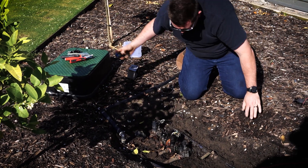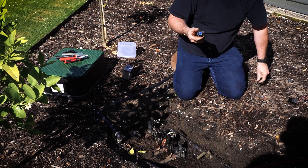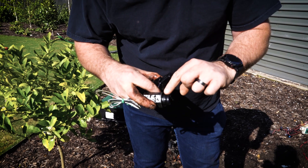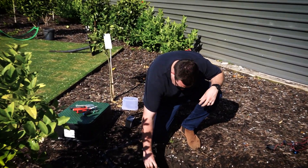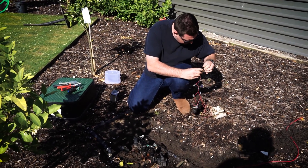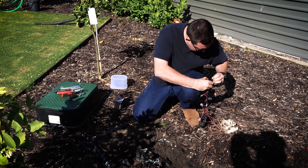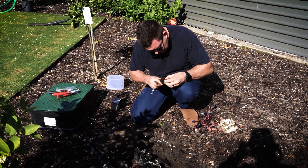It'll turn on okay but it won't turn off. If you don't feel resistance when you screw these on, that's a sign of a problem. That felt really light to turn compared to this one — I'll show you the difference. There's an O-ring here, but there's not an O-ring there. That one there will leak. I didn't realise there wasn't an O-ring on it. I could feel it — there was no tension at all when I started screwing it on. I'm hoping we can steal one from the others. That's how easy it is once it's sorted.